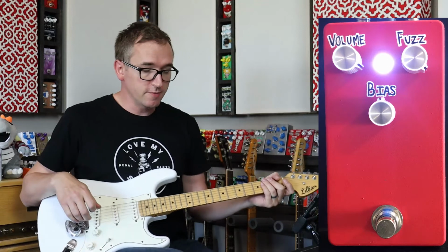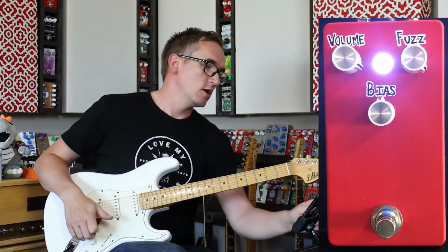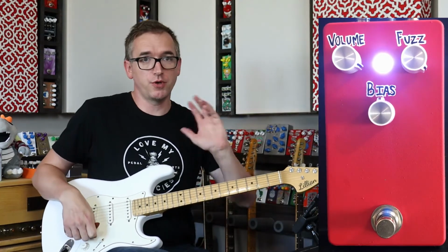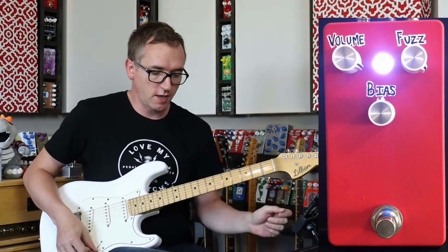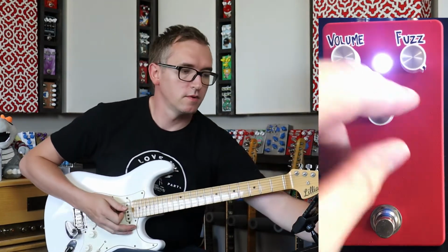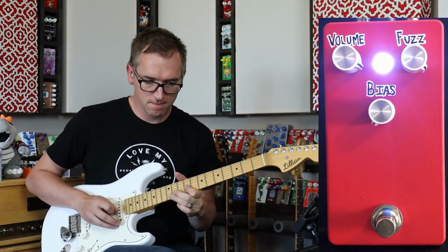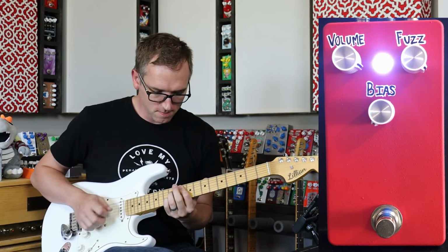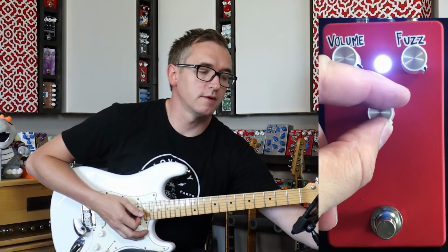So if you remember, we dialed that internal bias in to 4.5 volts, keeping the bias right in the middle. So what I'm gonna do here is show you what happens when you turn that external bias and the different kind of sounds we can get. Now we're gonna go all the way over to the other side.